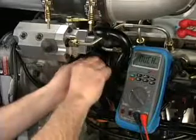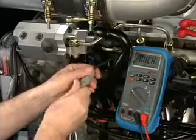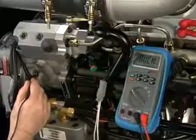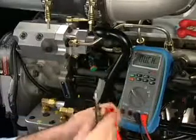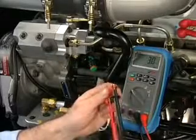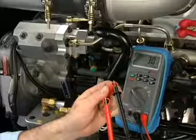The fuel pump actuator can be tested for open and short circuits using an ohm meter. Resistance from the positive fuel pump actuator pin to ground must be at least 100 k ohms. The resistance from the pin to pin of the actuator should be 1.5 to 5.0 ohms. If the actuator does not meet these conditions, the actuator must be replaced.